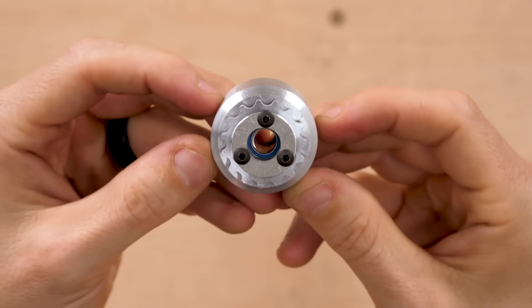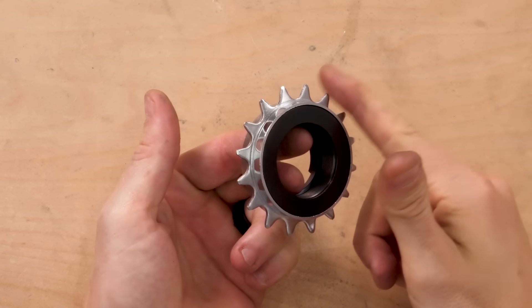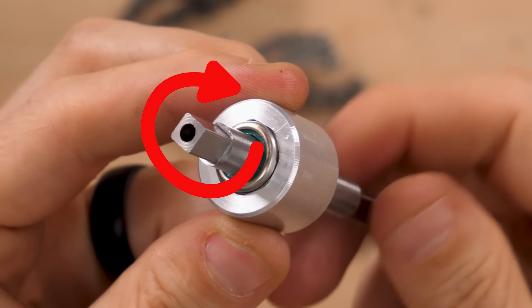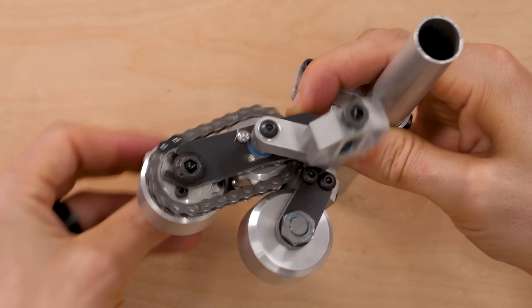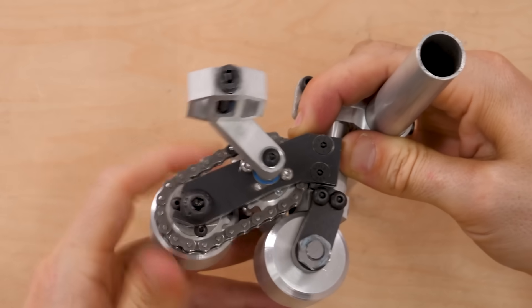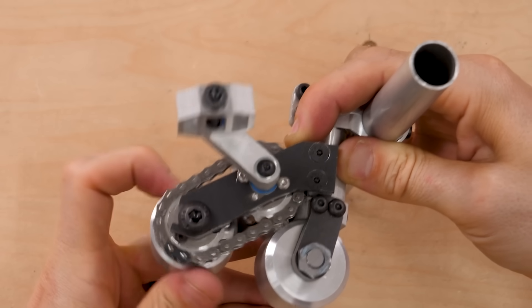There was no room to fit normal bike components so I had to make my own. Making the gears is pretty easy, but how to make it coast was not obvious. A normal bike uses a freehub, which is just way too big. I eventually found a one-way bearing — they let a shaft rotate freely in one direction, but if you turn it the other way it locks up. Putting this all together: the pedals go into the one-way bearing. If you pedal forward it locks up and spins a gear and you go forward; if you stop pedaling, the wheel spins the chain the other way, the one-way bearing spins freely, and the bike coasts.